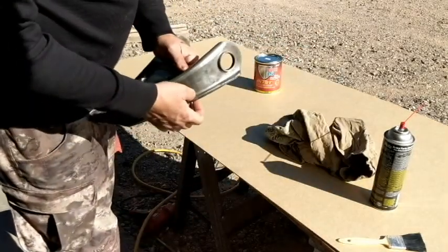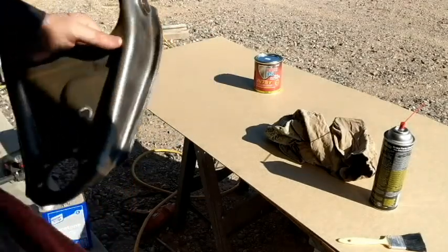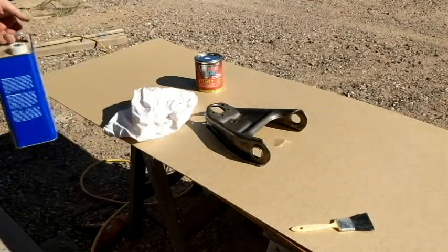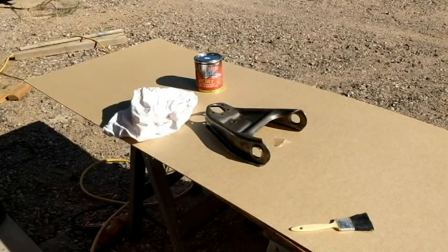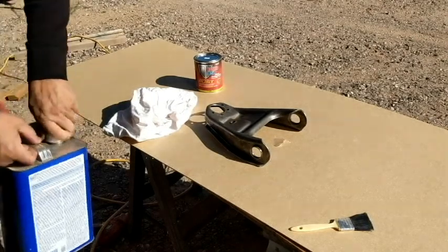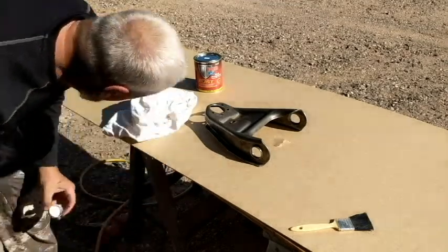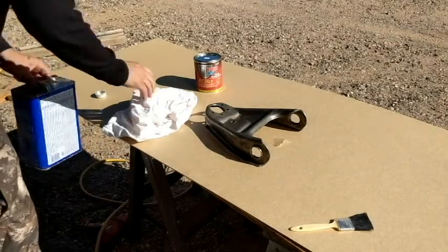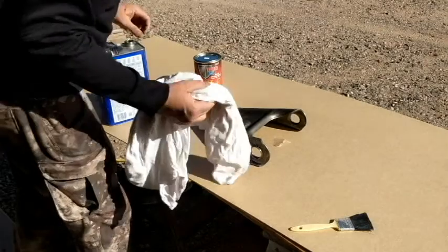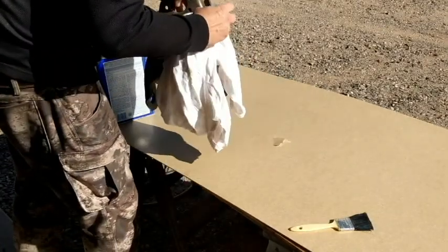I see more grease. All right, 20 minutes later. Got a couple more grease spots cleaned up. Finished with the brake cleaner. Clean up. And now I'm on to the acetone. I don't have to do any tack rag or anything like that. I don't care what gets in it or how it looks, I just want it to adhere.